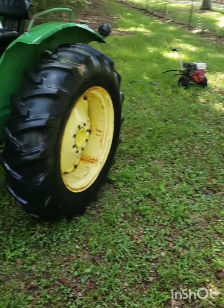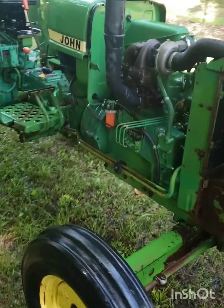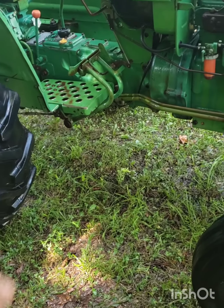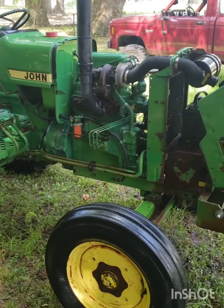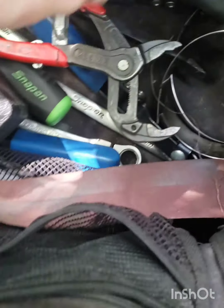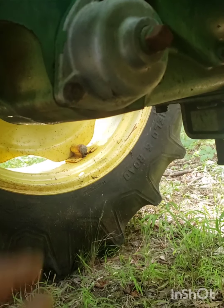We're gonna put the pressure washer up, then we're gonna put her back down in that hole and get to dropping all this hydraulic oil out of it — or should I say, mostly water. I got everything but one strainer filter that's in the bottom of the case. We're gonna drop the hydraulic filter, all the oil out of it, pull the strainer out and clean it. Don't see a drain on the bottom of the transmission, but we got this. I know my strainer filter's in there — that's the one I'm waiting on.